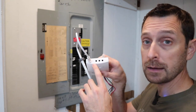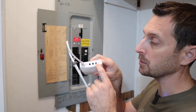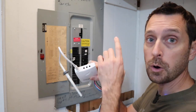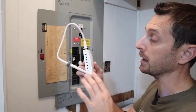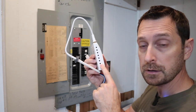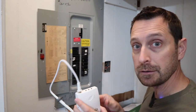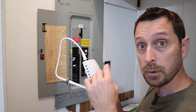For quick reference: your main 200-amp sensors are going to plug into the A and B ports on the top of the hub — put a plug in any unused port to keep dust out. Those 200-amp sensors go on the main conductors coming into your electrical service panel. All the leads for your other circuit sensors will plug into both sides of the hub, and those sensors go on the conductors feeding each individual circuit breaker.